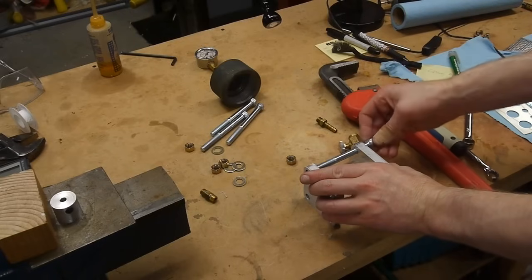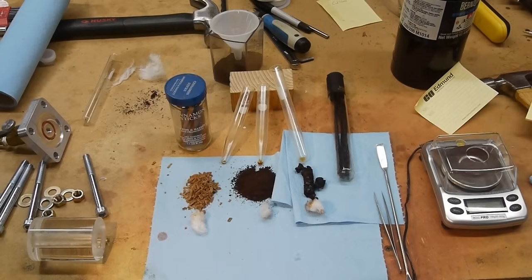This is really much better done with metal — stainless steel would probably be the best material to choose. But I really wanted a clearer material so that I could see what was going on in the extraction chamber. One problem with using acrylic is that the supercritical CO2 actually penetrates into the plastic itself quite easily, so you really can't leave this set up for a long time, like a day or two, to get more oil extracted from your ingredient, because you'd actually end up extracting a lot of the plastic itself.